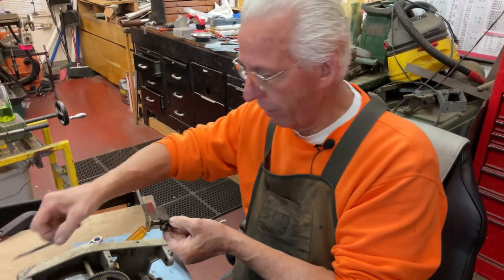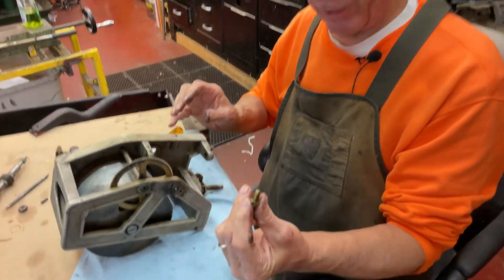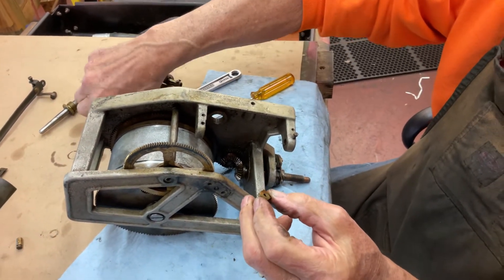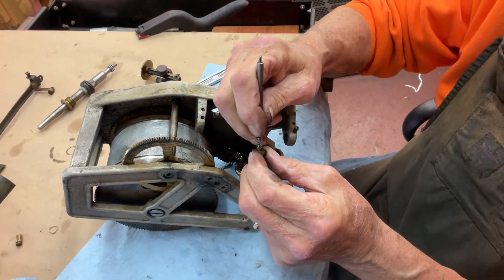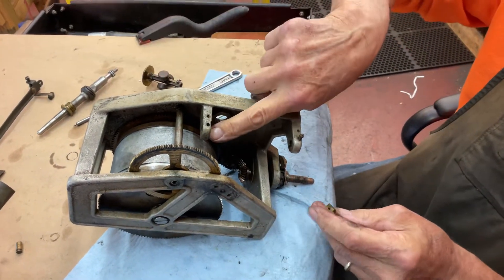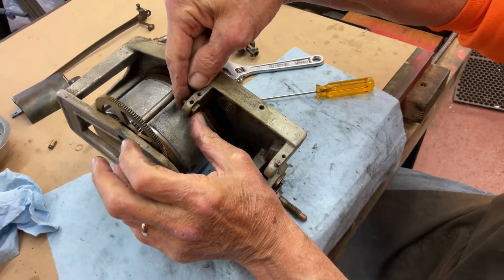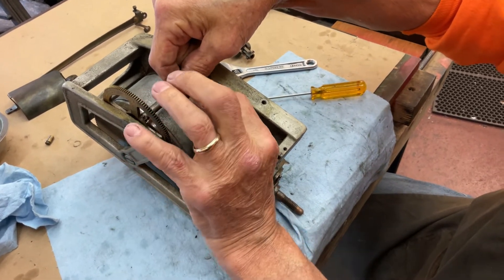You want to make sure when you start to assemble this thing back that you have all the screws, and then you have this inner bearing for the other end of the governor, which fits right in here like that. We're checking that for tightness — that's good. And then this has a big hole in it, so when you adjust it in, this is their version of an eccentric. This moves up and down like that to adjust it.